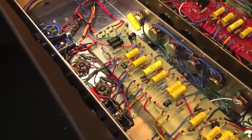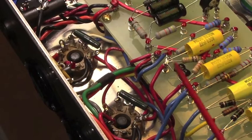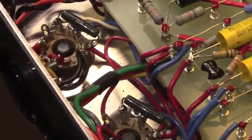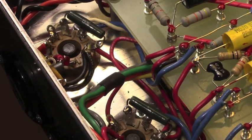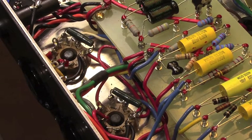One thing that I really do insist on: these 5-watt vitreous enamel resistors — new old stock — I really feel those are important to the overall sound of the output section. Marshalls of the 70s and 80s came with this style of resistor for their screen grids. Those are screen grid resistors. I think they're really important — they handle what they have to do in just the right way, they stay cool, they don't fail easily. They do sometimes fail, but they have the right sound and do the job the way I want them to.